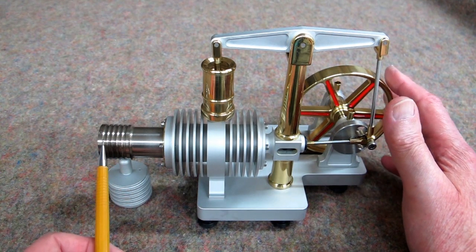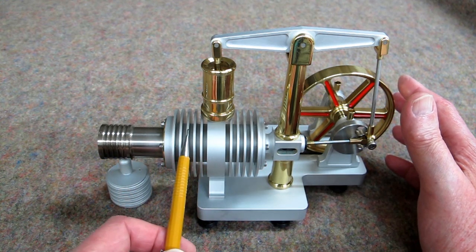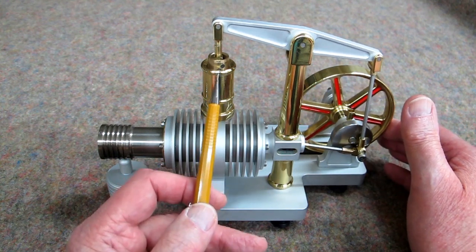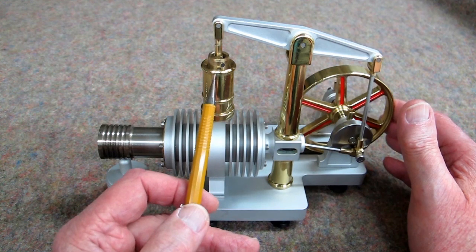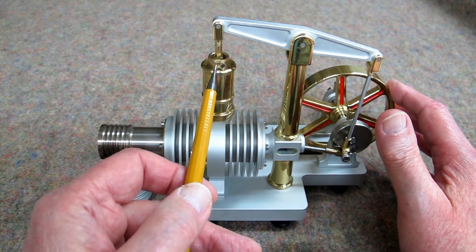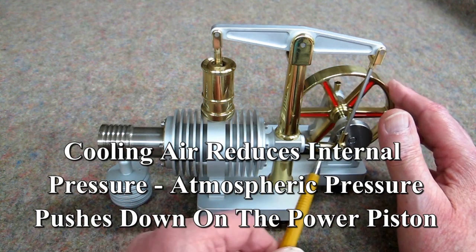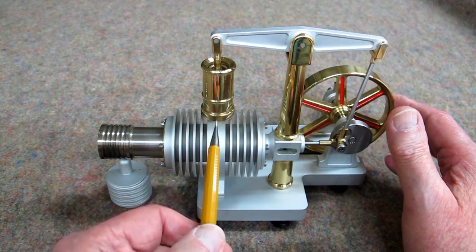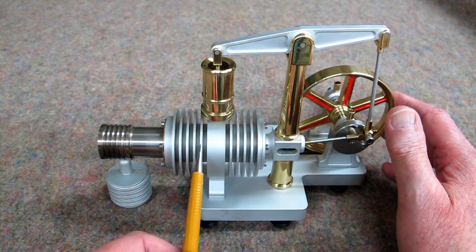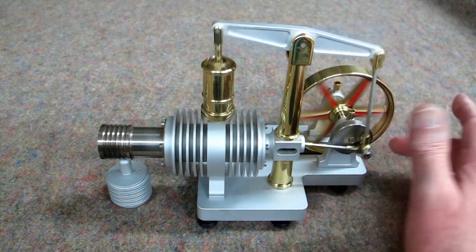The fire under here — this gets hot. That air is expanding. The displacer is back here; it's expanding, coming back into this section where it's going to get cooler, and trying to get up into this cold cylinder, which is the power piston. As that air expands it will push that piston up. The displacer is starting to come forward. The power piston is moving downward. Air that has been allowed to cool slightly is being pushed back out into this area. The displacer is forward. The power piston continues to push that cooler air forward. The air is now heating up again and expanding — it comes back into this section and causes the power piston to rise again. The momentum developed in the flywheel keeps all of this going.